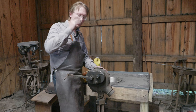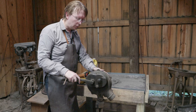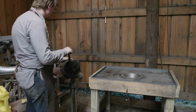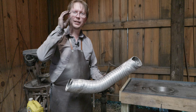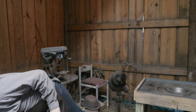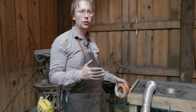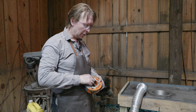It's still pretty noisy — it sounds like the fan is rattling in there, which may mean it needs to be adjusted on the set screw. I'm not going to worry about that for right now. We've got the forge in place and the blower pretty much where we want it. I've got some dryer venting — this is really not a great material for it, but I've got it so I'm going to use it along with some duct tape. Ideally something that doesn't fall apart as easily is a better choice, and having a clamp to hold it on is also better, but you work with what you've got.